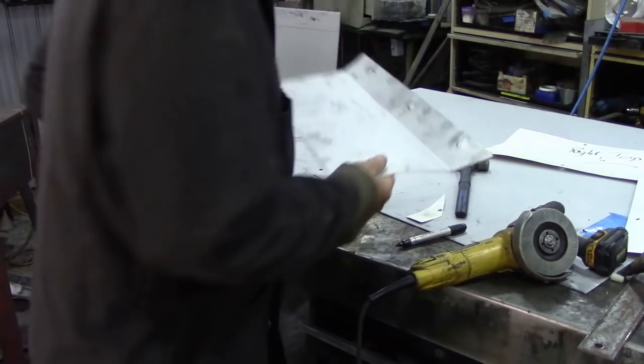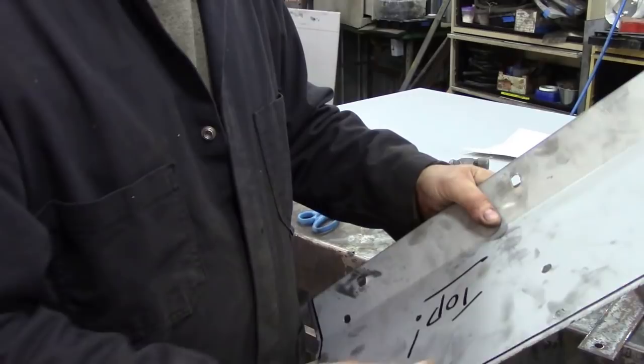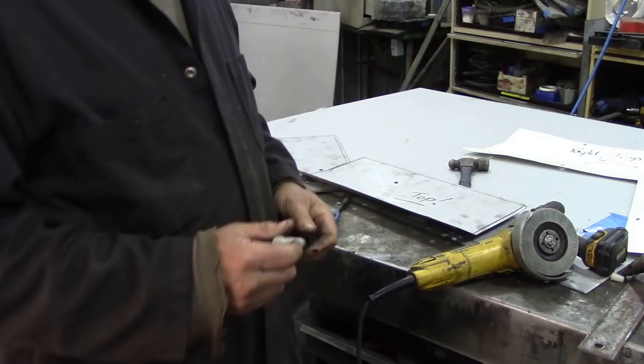The next thing we're going to do is we've got to put a line of holes in for spot welds. Get your Sharpie, run it down, like that, look. You see? Just run it with your finger. Just get a guideline. You don't want them too near the edge, but you don't want them right in the middle because you'll miss out where you're going to weld onto. Let's make some spot weld holes.